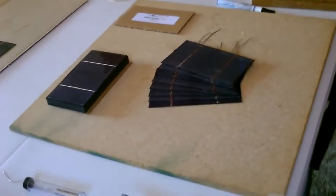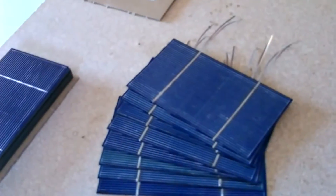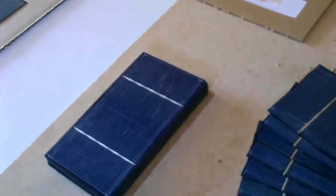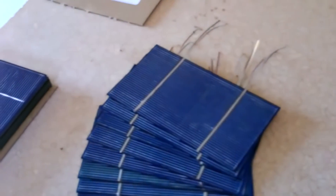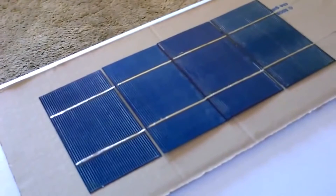Okay, and there's a bunch of them done right there. That took me about 20 minutes to do those. So I'm going to keep working on these, but that's how you start: untab solar cells, tab a bunch of them. And then the next video in the short series is going to be how to put them into long rows to make full-size solar panels.